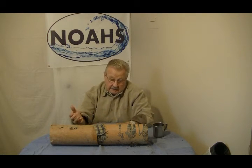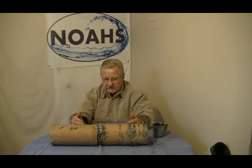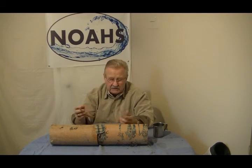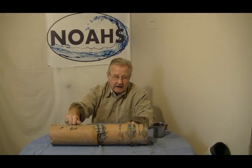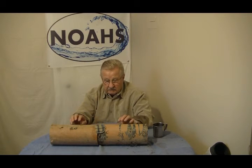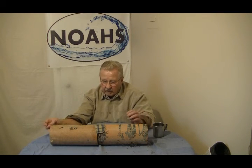I don't know who taught my old man, but it's a great detail. This foundation draining system is tantamount to keeping your basement dry. If it doesn't have the proper grade — which I believe is one inch per 100 feet — you're going to get leveling issues. There's an old wives' tale that these get damaged, but I've never dug up any damaged ones in over 1,500 to 2,000 applications. They're not all ceramic weeping tile, but they are very, very stable and hardy. They don't collapse, they don't deteriorate, they don't rot.